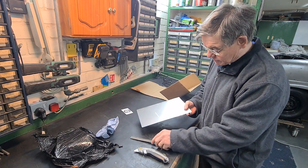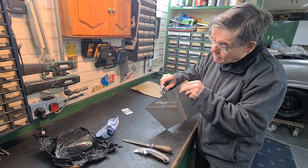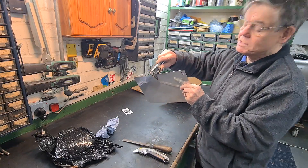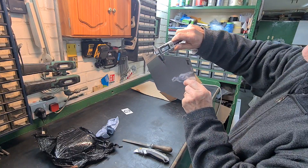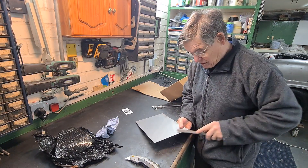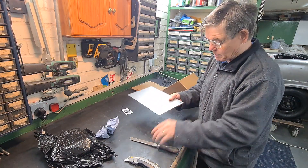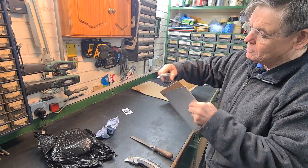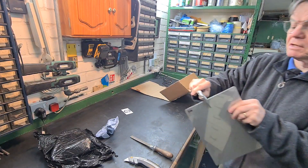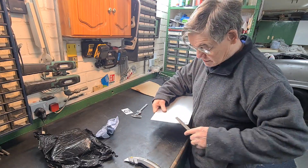This is supposed to be 0.7 so I'm just going to check it. I'll take that burr off - actually I can measure past the burr. It's 0.66, 0.67. It seems as though most sheet metal is never over the stated dimension, it's always a little bit under. But I'm splitting hairs here because of my background in tool making - I think a little measurement is a lot. So that is 0.66, which is 0.04 of a millimeter under, so that is effectively 0.7 - that's correct really.